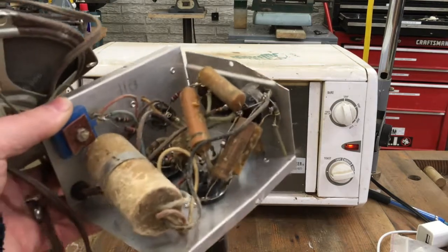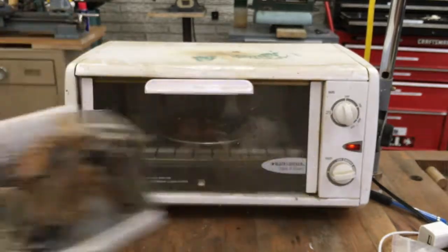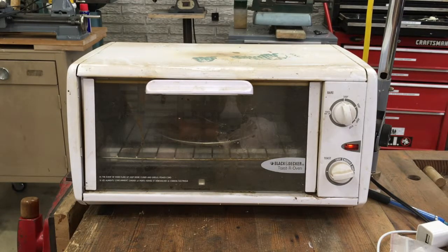Here's another old radio and you can see there are many in here that are the same kind of setup. You can get modern capacitors and they'll go right in and work just fine. But there's a certain group of weirdos that like to gut the old capacitors and rebuild them so they operate as new, will last another 50 years, but look original and fit in the original sockets or chassis. In this case I don't really have a reason to do this since it's going back in a radio you can't see inside of, but I just thought it'd be fun to learn how to do.